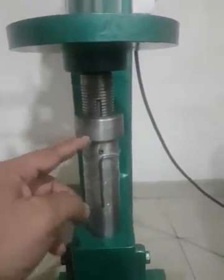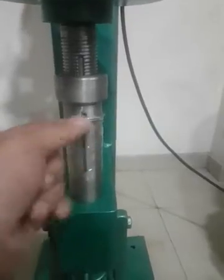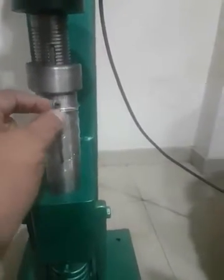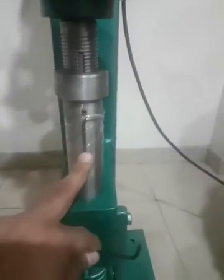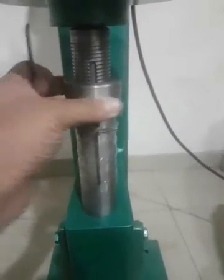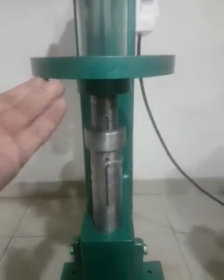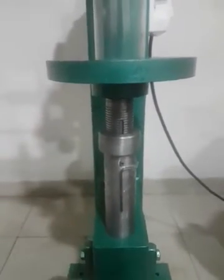You can see there's a screw over here. We have to unscrew this a little — we don't have to take out the whole screw. You have to unscrew this with the help of an allen key, which is already provided to you. After unscrewing this, we will use this to increase or decrease the height of the base plate.